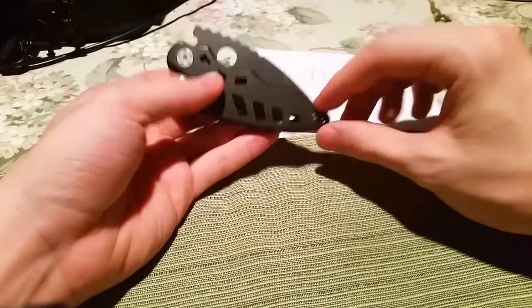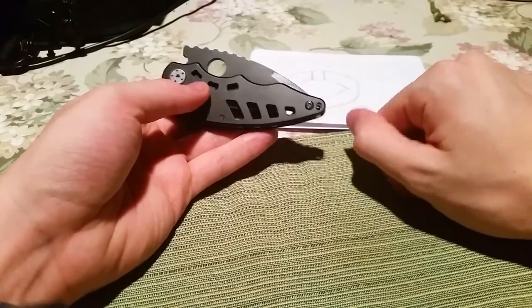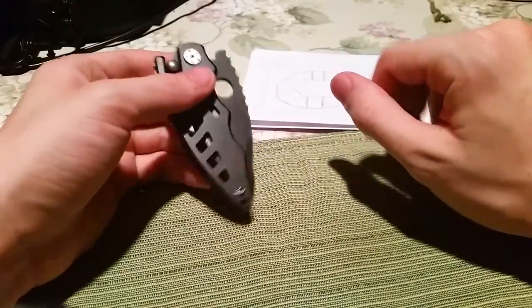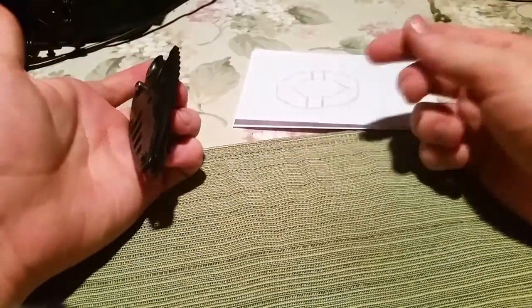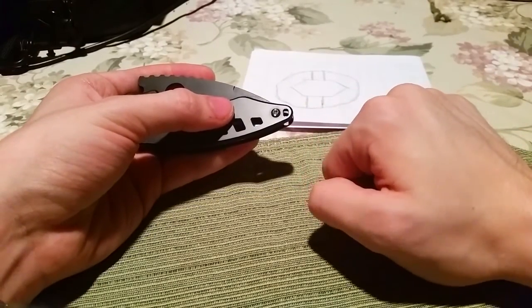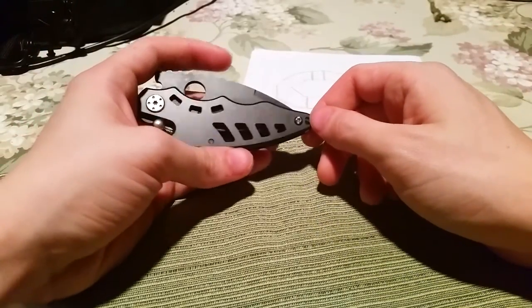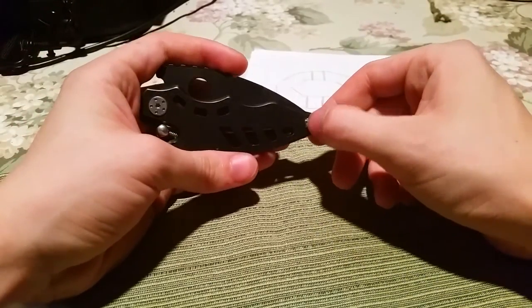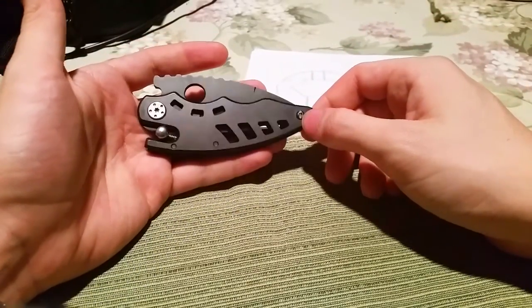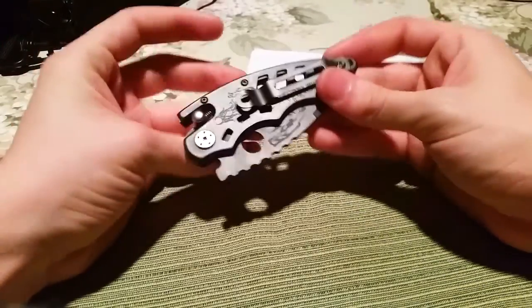The way that I did this was by taking a triangular file and getting it started where I wanted it to go, and then I took a hacksaw blade by hand, close to the very tip of the blade where it attaches on, because you never really use those teeth anyway. Then I just went back and forth slowly so that I could control exactly where it was going to fall, and just kept at it slow and steady so I could constantly monitor how far into the screw itself I had cut the groove. I gotta say it holds really well.